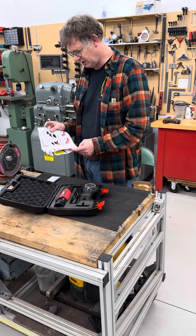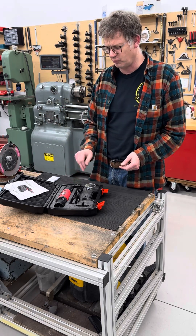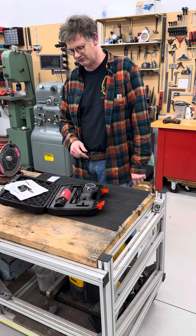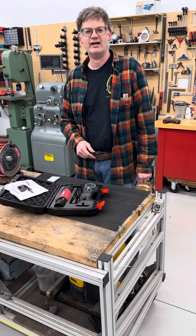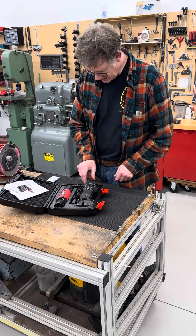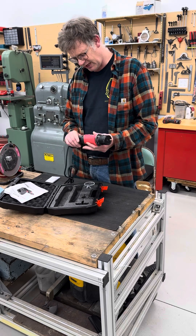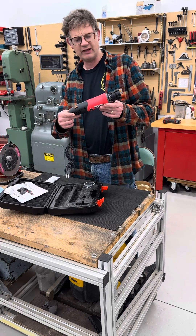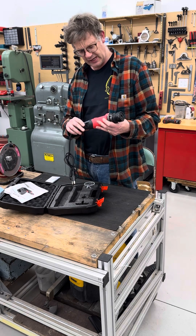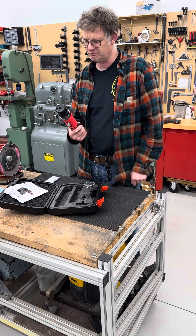It doesn't look to be too bad of quality. A lot of these little grinders appear to use Dremel tool bodies, and I wasn't really excited about that because a lot of people say the motors have problems. What attracted me to this one is it has a pretty heavy-duty body — not quite an angle grinder, but getting close — and it was pulling quite a bit more power: a 450-watt setup.